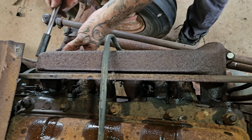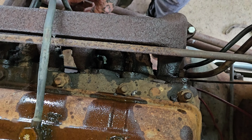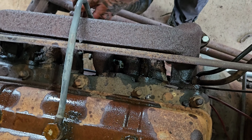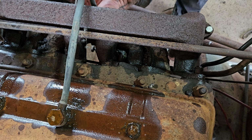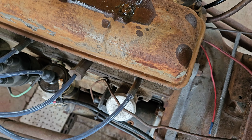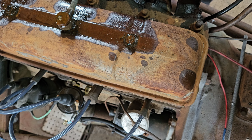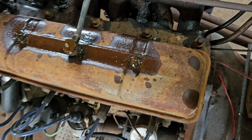Alright, so we're after the exhaust manifold gasket. It's leaking so bad you can't even hear yourself think working on this thing, so we're going to pull the exhaust intake manifold off, put the new gaskets in there, hope for the right ones, because there's two different versions, and I don't recall if this was an 80mm bore or 85mm bore. But I guess we're going to find out as soon as we pop this open. And if it's the wrong one, then I'll be talking to Sue again.